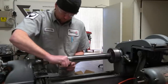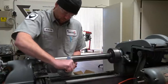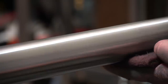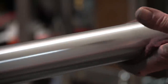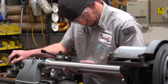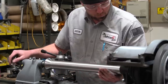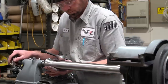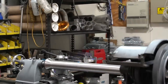We're going to start with some two-inch OD DOM tubing with a quarter-inch wall - some big heavy-duty stuff. As most DOM has it, there is a mill scale on the outside which has to be removed. The fastest and smoothest way I've found is to chuck it up into the lathe, spin it with some emery cloth, and then polish it up with a piece of scotch-brite or a surface prep pad. This gets it perfectly ready to weld.